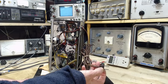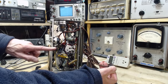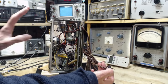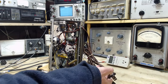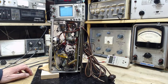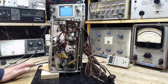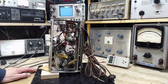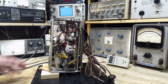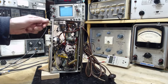So when you plug it in this way, you may get 120 volts, full tilt on the chassis. And that makes the radio dangerous for people who will take it out of its cabinet, like me, and mess around with it. So you can't just run a wire to the chassis. As effective as that would be, it introduces a danger to the radio. That danger, by the way, is right out on these knobs, potentially, especially this one here.